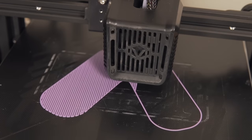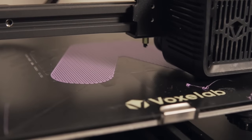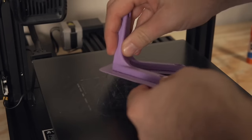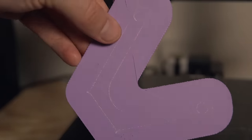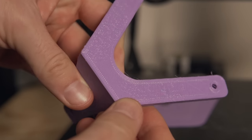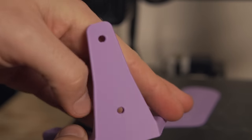To be perfectly honest, I haven't used rafts in years, unless I'm testing out a 3D printer and on the memory card there is a pre-sliced file that just so happens to have a raft on it. I have seen other people use rafts the way I use brims — where if they're printing with some kind of high temp or more warp-prone material, they'll lay down a big raft and then start printing their part on top of that — but that is not something I have used them for. Rafts are typically printed with fairly large extrusion paths that form a coarse grid that your part will be printed on. My biggest issue with this is that unlike printing on glass or PEI that gives the bottom of your part a nice clean look, when you remove your part from rafts, it's typically not the best looking. I understand that in situations where you're possibly using a raft, maybe the aesthetics aren't the most important and you're just going for success, which is totally fine.